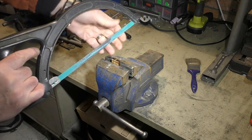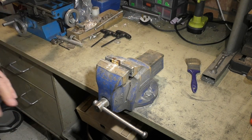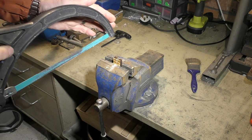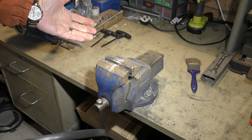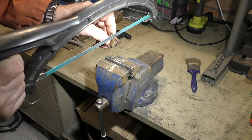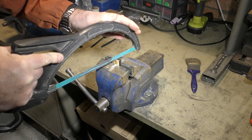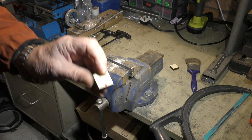Here we've got a single blade that cuts right through the material in one go. That is not how laser cutting works. That material is only just barely sitting in there. What happens if I try to cut it? Yeah, I know I'm being stupid. The point I'm really making here is it requires resistance between this blade and this material to effect a cut. There is a force required, a mechanical force required for this sort of cutting. So we now know that it's nothing like using a saw.